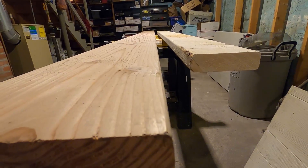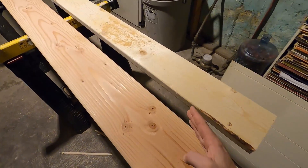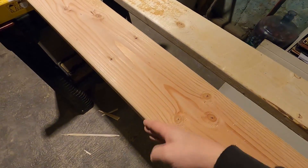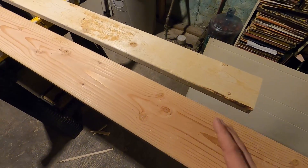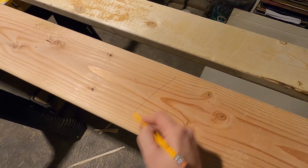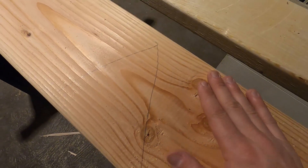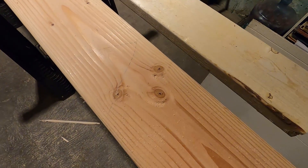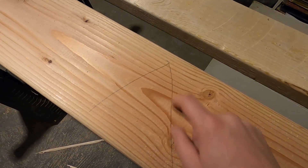So why is that important? Well, when you find the crown — like I said, this side goes up and this side kind of goes like this. Sometimes it will be completely straight with just a bump, sometimes you can barely tell, and sometimes they're really bad. Since the crown is there, I'm going to mark it like this. If this is a finished board, you're not going to want to mark it because that's going to show. But this is just framing in my basement, so if you're doing a deck or something, you probably don't want to mark it.